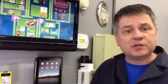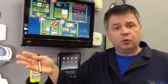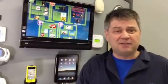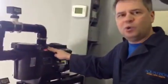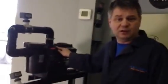So there's three components to close here. Number one is that with an IntelliPro pump, you can reduce your energy consumption by up to 90%. And my pump at home, that means about a saving of $500 per year by shutting off 13 light bulbs that run 24/7. The next thing is, because it's a permanent magnet motor, your life expectancy is 3 times as long. So in the time that you would own this, you could potentially own 3 other appliances, so a 10 to 15 year life expectancy.